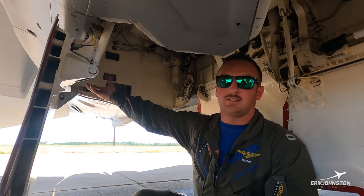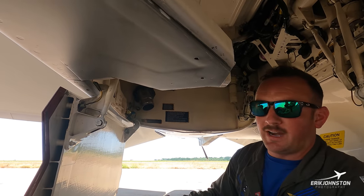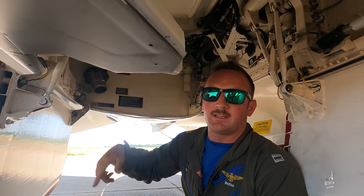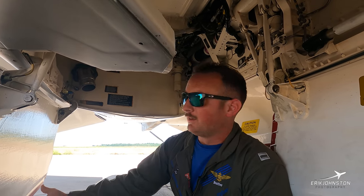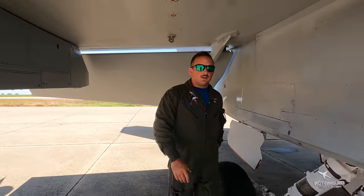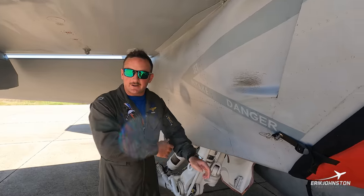The APU is what's going to start the jet — 3,000 PSI is what you need. Here's the exhaust — it'll blow out once you fire up the APU. Battery power alone will fire up the APU; it's got enough power to get it turning. Once you've got the APU online, you'll go ahead and cross-bleed the APU air — it's basically a little jet motor inside. It produces a bunch of air that you dump into the General Electric motors, and they'll start cranking. We've got an awesome fuel control system that's really just kind of automatic from there.